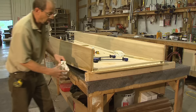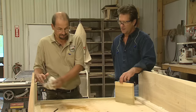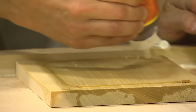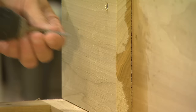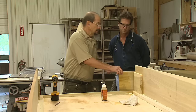It's something we won't have to clean off later. We've left this tube in front of the boat to keep our arch in place while pulling up the front to match our cut on those side rails. The sides are done. These pieces are going to be cleats for our back seat. We're going to sit these in place and glue them, wash them down just like every other process. The measurements are 10-1/2 by 7-1/2. Our seat's going to be 12 inches — that'll give us a little overhang and a little pocket box to set stuff underneath while traveling down the creek.